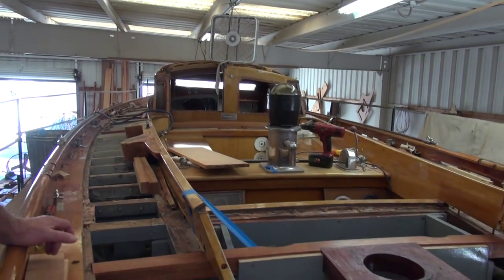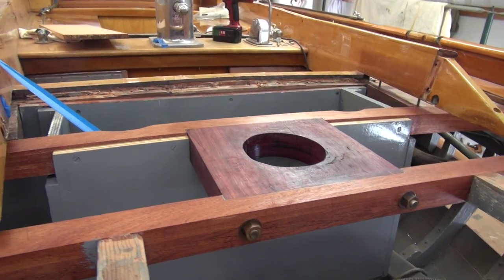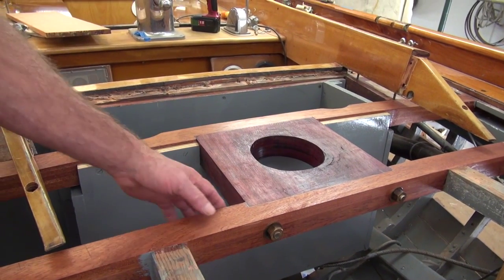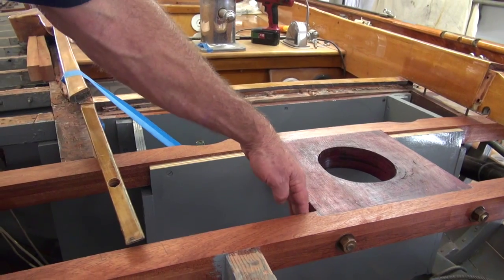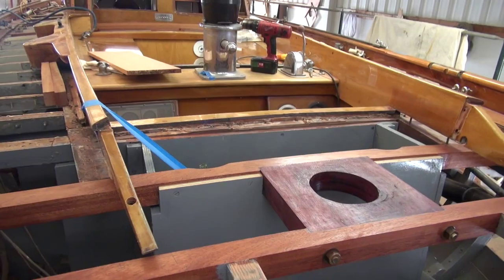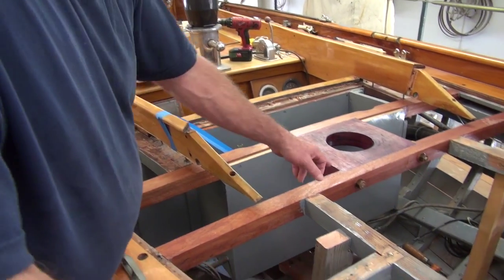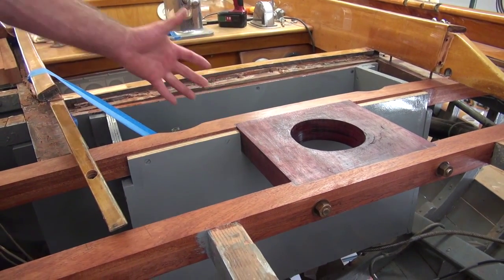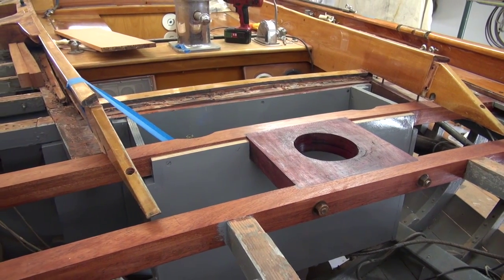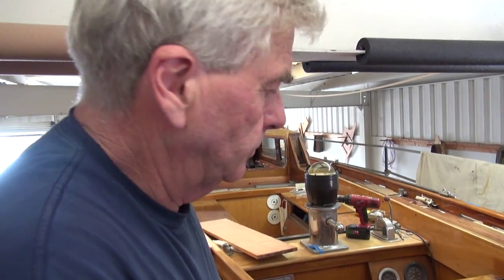So these were new beams that you made. I remember the bolts were all rusted — everybody might remember all the bolts that were rusted. The original ones had bolts running right alongside the blocking, which was, as John said, more or less just pinching the block. These pass through the block, so they're squeezing everything together but also acting as half-inch bronze rods to keep it from splitting.